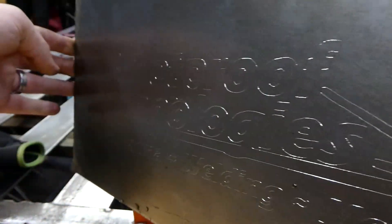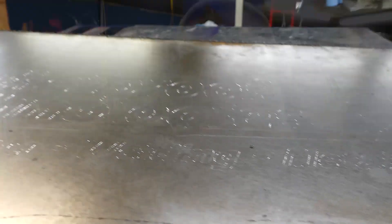The camera has a hard time picking it up, so it didn't turn out the best on camera, but let me know what you guys think. I'm definitely going to revisit this and use it in more projects. They say this scribe will last hundreds of feet, and so far I haven't had a single problem with it showing any dullness. One thing I noticed is paint was getting under the etch when I was etching the painted piece — that's why you saw me wipe it off a couple times. On the painted one I was running at 100 inches per minute; on the bare metal one, 150. By the time the table ramped up to speed it was only getting around 100, and on the paint it was about 75–80 inches per minute. Still, my logo took 7 minutes to etch — that's pure time Mach 3 shows on the computer.